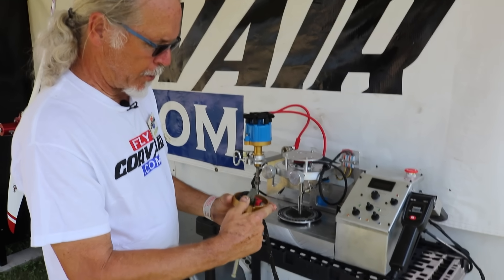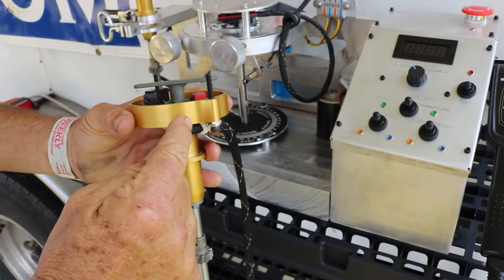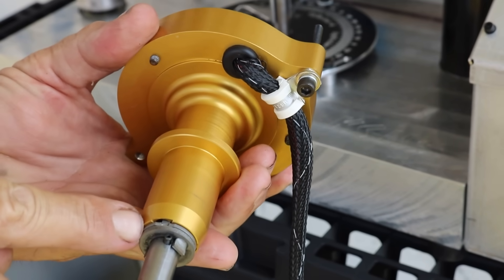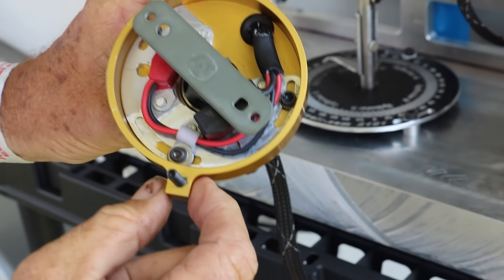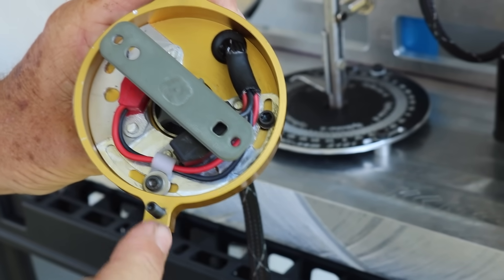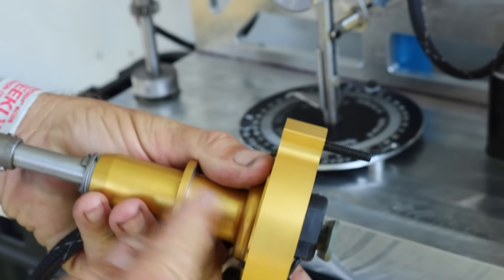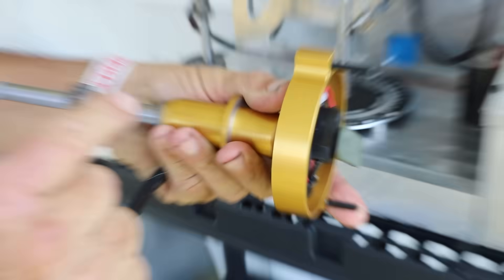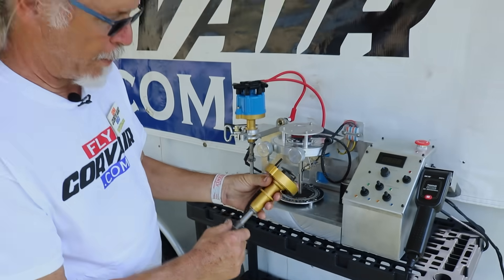Come in for a close-up — this is a five-axis machined housing. It's a body of rotation down here that can be made on a lathe, that's not a problem. But if you look at the top, the top fits a modern Ford distributor cap, and the modern Ford cap is asymmetrical. When you have an asymmetrical side to a body of rotation, you need a five-axis mill to do that efficiently. These are made on absolutely modern first-class equipment.